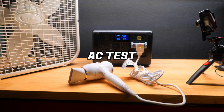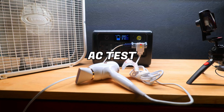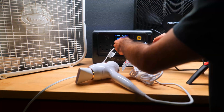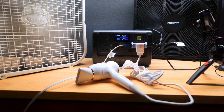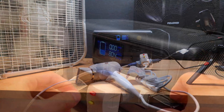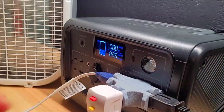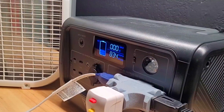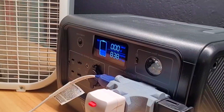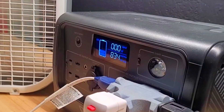Now we're going to jump into more advanced testing to see if the EB70S can continuously run at the 800-watt max output it claims. To test this we plugged in a few different devices to push the power station to its limits. I found the max sweet spot by plugging in a variety of box fans and a small hair dryer — it hit just shy of 840 watts, slightly higher than the 800-watt stated, and appeared to be throttling the output. Overall the output was about 105% of what they claimed, so they definitely met expectations in this category.